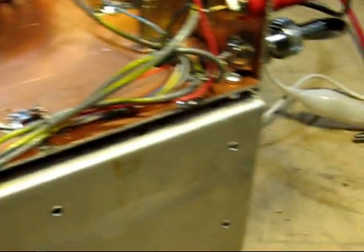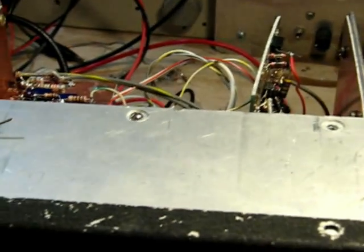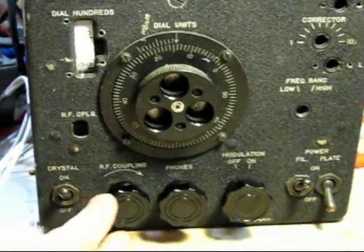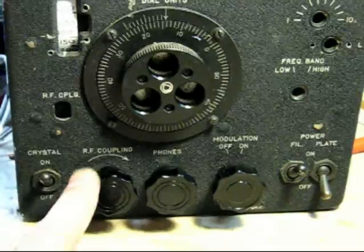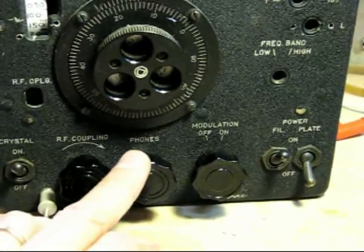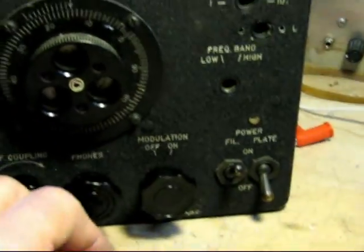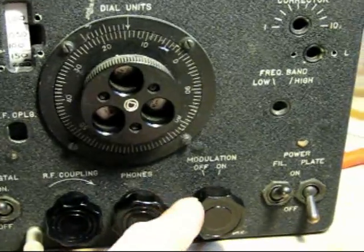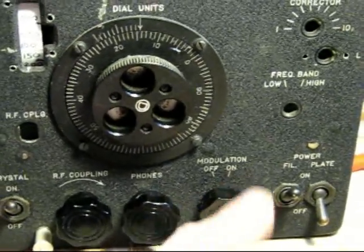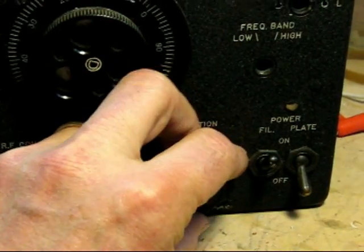The idea is that I can have all the wiring nice and tight. I'll probably have to shoot another clip to show the capacitor inside the box. This is pretty much what it looks like right now. I'll probably repaint the front. I've got a speaker jack, and I might even get a speaker built into this box. I've got audio gain, and this is IF gain based on just the IF portion of the hybrid AGC IF amp. There's also a band switch, which was part of the old frequency meter radio itself.